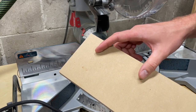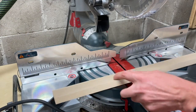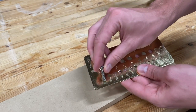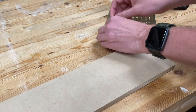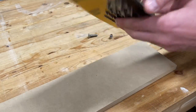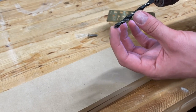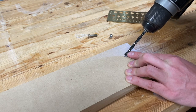I've put a couple of dots in the spots where I'm going to drill through, and then I'll countersink from the other side — I'll probably put a backer board on. Let's check the size of these machine screws — they're quarter inch. I'm going to open up some new brad point drill bits in quarter inch. One of the great things with brad point bits is that center point — you can put it right on those dots and it gives you a nice clean cut around it as well.